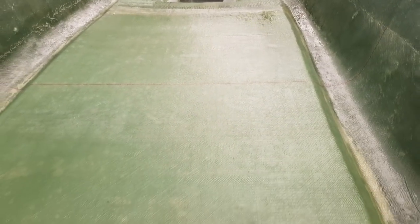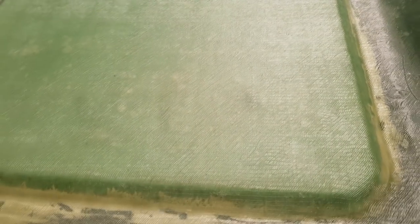Basically one layer away from being finished now. So that's now got 20 mil of foam, which I basically had to kerf to make it fit into this slight curve. And man, summer, it's just killing me. I come in here, I get about 5 hours work done, that's about all I can handle. 30 degree days, 80%, 90% humidity, you just can't laminate in those sorts of conditions and get a good job done. So I'm sort of missing days and doing other projects like the truck and the trailer sailer and concentrating on the specking out of what ultimately will be my catamaran.